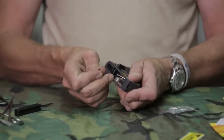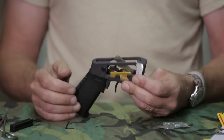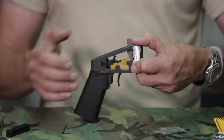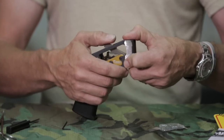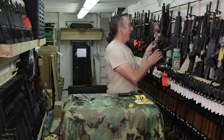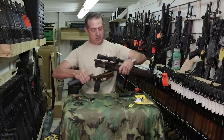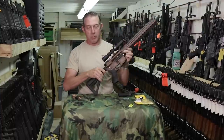Once that's snug, go ahead and take the hammer spring and rock it back over to the side where it is. Bring your hammer back — your pins should not fall out. You can test the trigger before you put it back together, making sure it doesn't come all the way forward to hit the receiver, as it might possibly damage the receiver. Once you have the trigger in, simply go ahead and lock the hammer back, take your upper receiver, put it back together, and there you go. If you have any questions, please leave them below. Thank you for watching Tactical Rifleman.